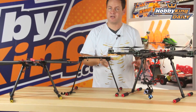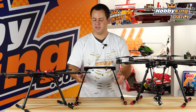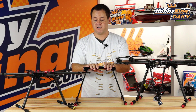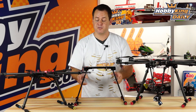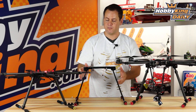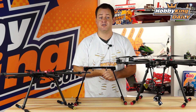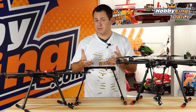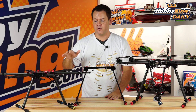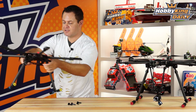The second landing gear option has hard mounting points that are directly compatible with this frame. It's not an economy version — just a different design. It uses aluminum tubes, still retracts and gets out of view, but doesn't have the quick-release option. The aluminum tubes are slightly lighter, making it a lighter configuration overall. The top still disengages from the bottom and the arms sweep up, so it remains a highly portable solution. It really depends on what you're utilizing it for.